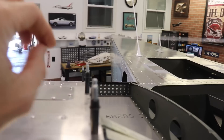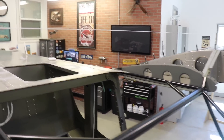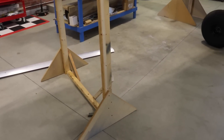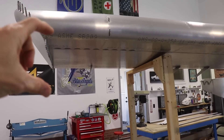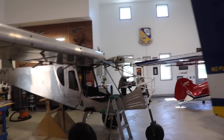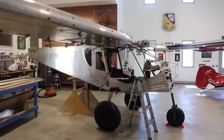I cut a piece of wood 95 millimeters and put it under the string — that's how I set it. It's kind of like a puzzle: if the string is a little high on one side and perfect on the other, moving that wing down also changes the opposite side, so it just takes very small adjustments on both wings. The way I change the dihedral while targeting 95 millimeters is by moving the wooden wingtip stand in or out — further out lowers the wing, further in raises it. It took a little while but you'll figure it out.